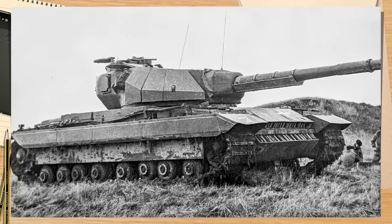The 183mm rounds were fired at the front glacis, left-hand turret cheek, and right-side suspension. Each round was only fired from 200 yards to ensure that key areas were struck, with the rounds having their charge modified to strike at the equivalence of 1,000 yards. One suspects this was also due to the very limited numbers of these vehicles made — rounds were probably quite expensive to produce, and therefore missed shots would have been costly.